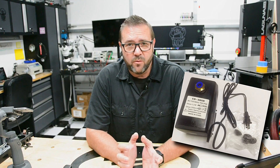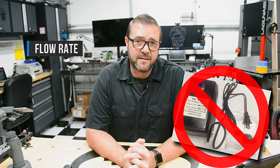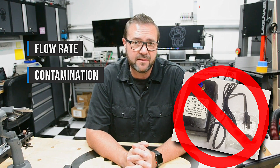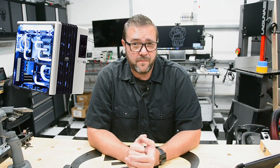Wiring the dedicated outlet and circuit was just the beginning. If you get a new spindle kit from Amazon, chances are it'll come with a fountain pump for the water-cooled spindle — and that's just not good enough for several reasons. A: The flow rate's inconsistent. B: It's not a closed loop cooling system, so dust and matter can get into the water channel and cause problems for your spindle. C: I really didn't have room for a 5-gallon bucket of water to sit next to the machine. In designing a closed loop solution, I researched the closed loop cooling systems used for PCs. While most of the pumps were low end and low pressure, the right parts were available for the price.